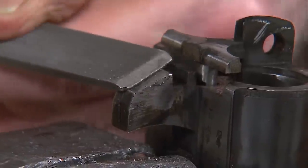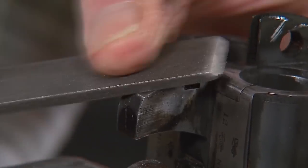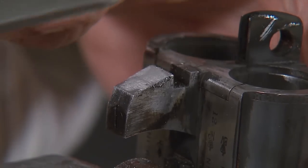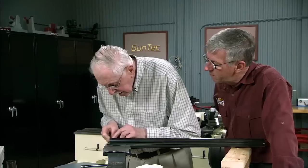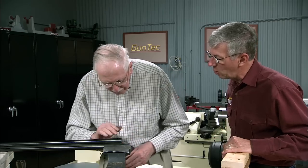This is a slightly finer file. I need a bit of emery cloth just to finish it off. Now going cross-grained first, then finishing up and down with the emery cloth — you want to finish it going the same direction, because it would look awful going crosswise. It's what they call in the trade putting a stroke on it. Wrap the emery cloth around the file — 400 grit. Dress down both sides, keeping the lines going the same direction that they normally would on the opening and closing of the gun.